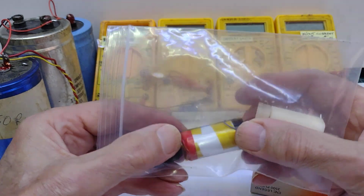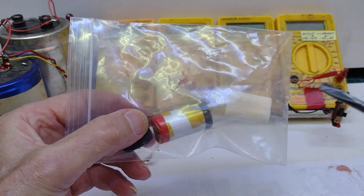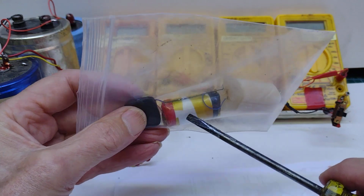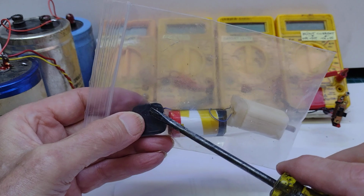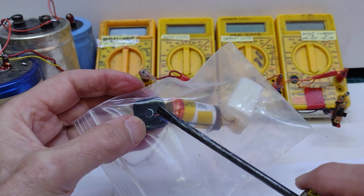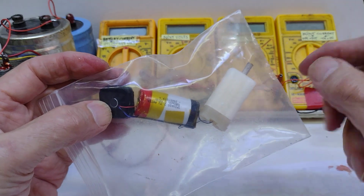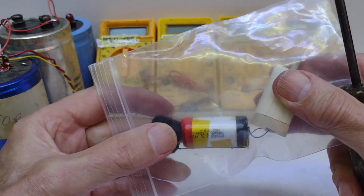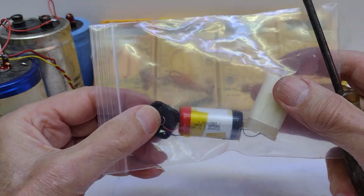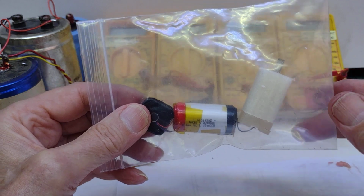What have we got then? If we look, we've got this device at the end holding the chemicals here with a heater on the inside. We have the cell. The blue wire from the heater comes from the sensor at this end, and there's the sensor, there's the cell, and there's the heating element. What I want to do then is to take it apart so that I can take some measurements from it. To do that, I cut it here and here, and then put in a socket.